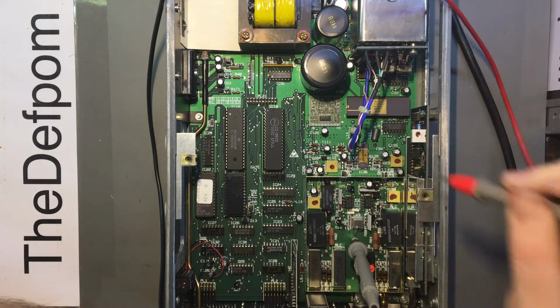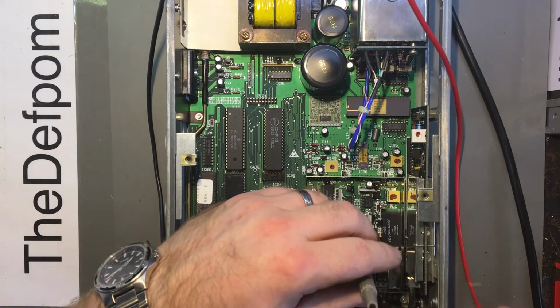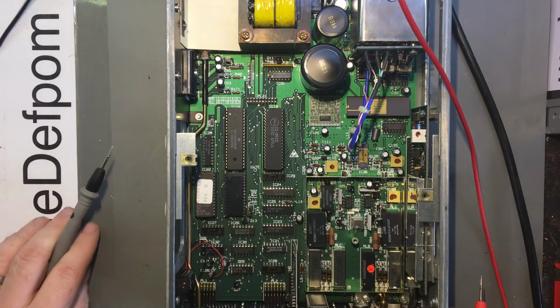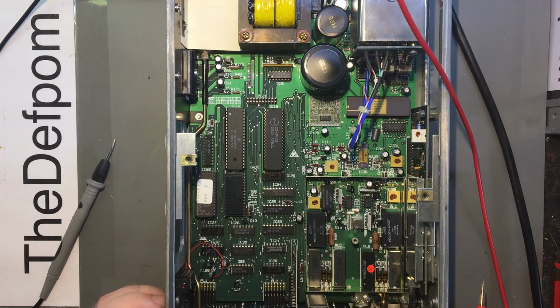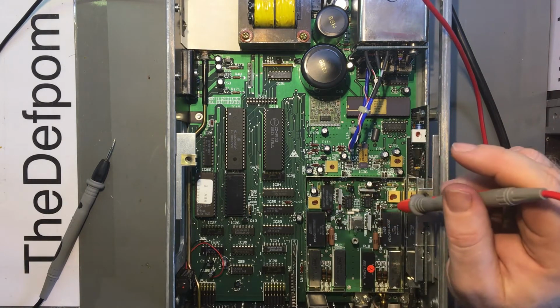Like I said, interestingly, the input triggering just does nothing on that channel. If I stick that probe in channel B, it's picking up noise and it starts triggering, whereas channel A is just on all the time, so it's not right. So I'm just playing with that again. Yeah, so channel A is just always on. So I need to try and figure out why that is.